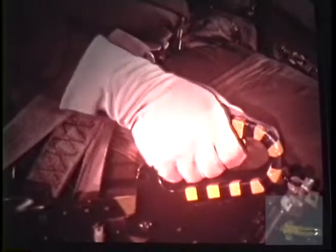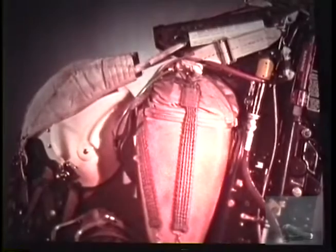Pulling the emergency harness release handle extracts the sear from the firing pin and the guillotine firing mechanism. The firing pin ignites the cartridge, generating gas pressure in the line to the guillotine piston, which drives the guillotine blade to sever the personnel parachute withdrawal line. The occupant can now pull the parachute from the support arch, push free of the sticker clips, and clear of the seat. Pulling his D-ring deploys the parachute, and he makes a normal descent.